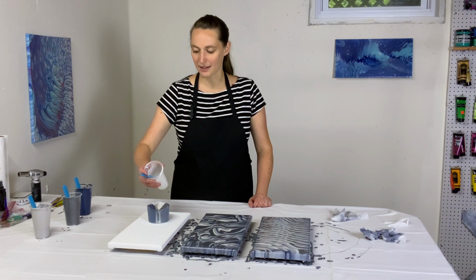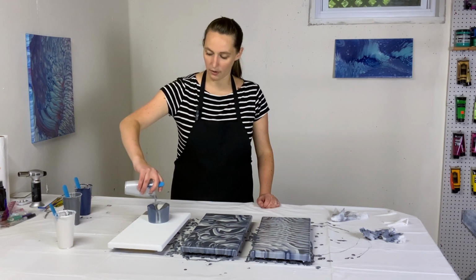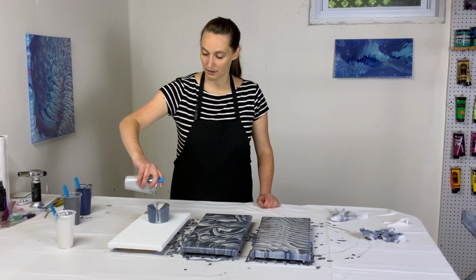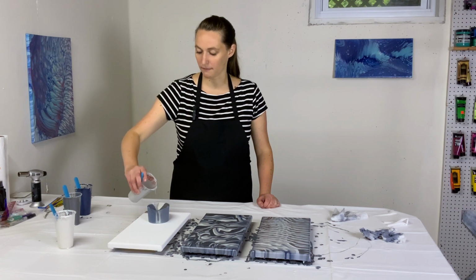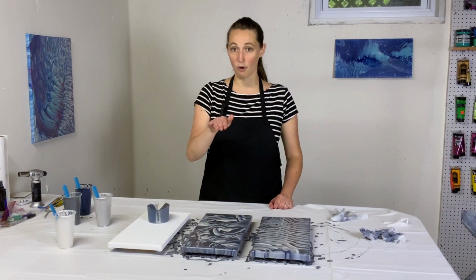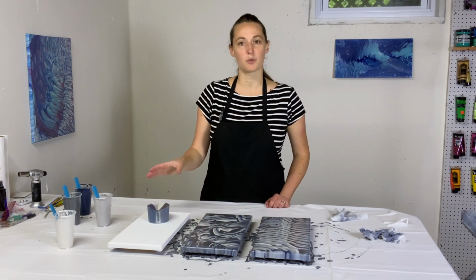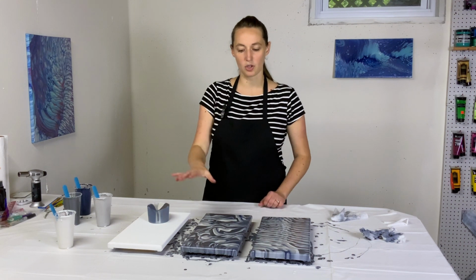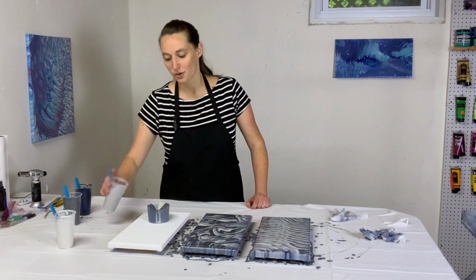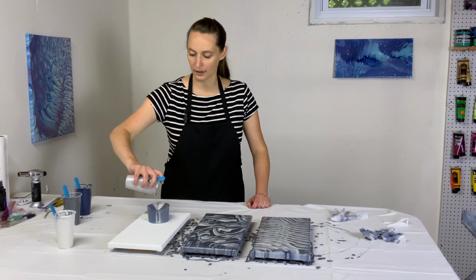So I'm going to go for a zigzag kind of a pour to see whether I can get any of that nice ladder Damascus pattern. Another great way of getting that pattern, which I thought about, would be to do a waterfall pour, you know, where you jiggle it down this way. But for that, it wouldn't be the split cup, it would be a stacked cup, and so it would end up with colors not so clean and defined as with this. So I did not do it that way, but that would make a really cool ladder pattern.